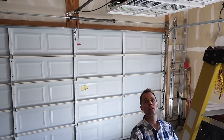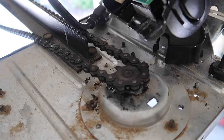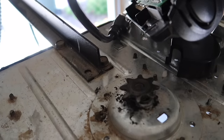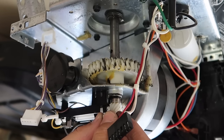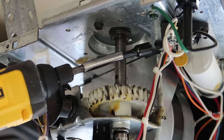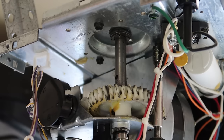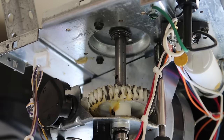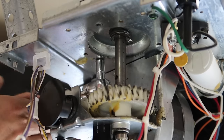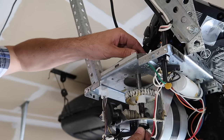That's plenty. I'll open up the garage to get a bit more light in here. Now that the chain is loose, we can take it off of this. On the bottom is this little plastic clip and gear that's just going to slip right off like that. Then we remove these three screws — the third one you can't use a tool like this for; you've got to use a socket wrench or a little crescent wrench because you can't fit it in there. It's 5/16ths. Now this whole part will just lift right up like that.